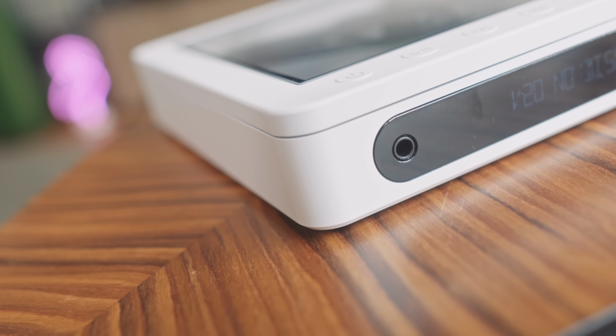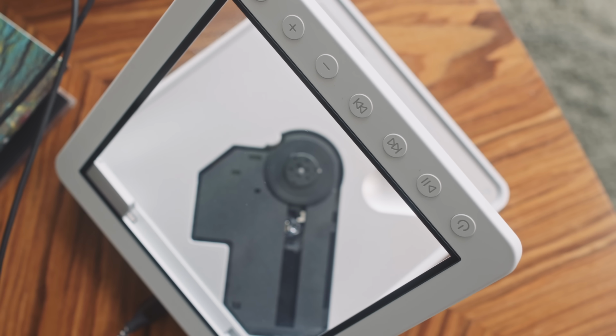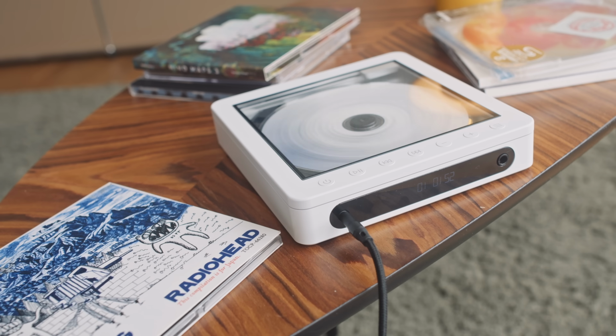So we can deduce from this that the DM13 uses separate chips for its headphone drive, and a quick jump back to FiiO's website confirms as much. I think they use a pair of SGM8262 to drive the headphones themselves. So this could explain why the DM13 is more powerful than the DiscDream 2 Ultra.